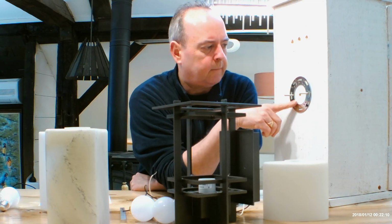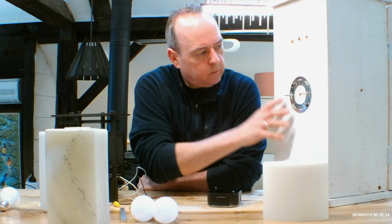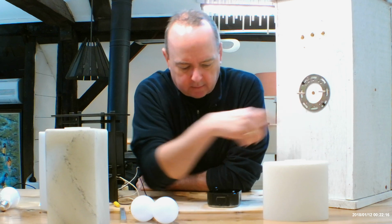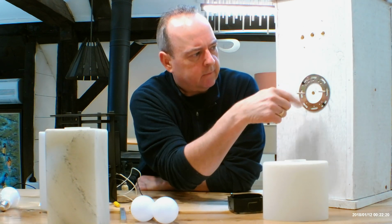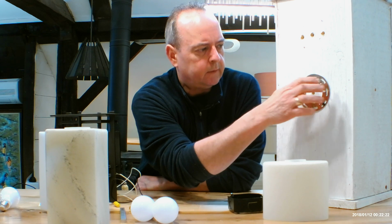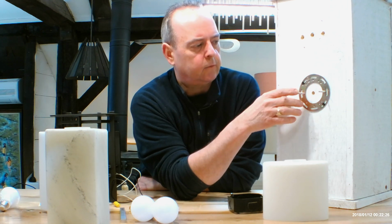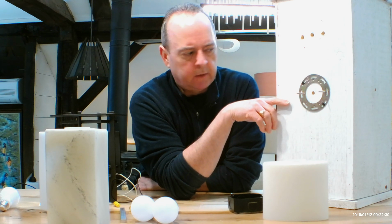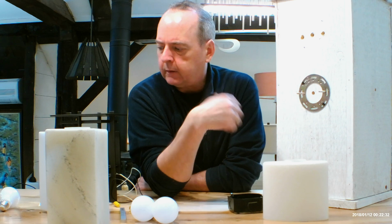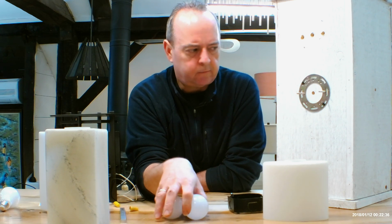This is a universal mounting kit, and you can see lots of little holes on this, and what that does is it goes on a variety of J-boxes. So it doesn't matter what kind of J-box you have, this is going to be able to get you to use it on whatever you have going on in your house or your building. Okay, those are those little threaded rods I was talking about a second ago. So we went over glass, we went over finishes, sockets, and those are the really important things on this fixture.